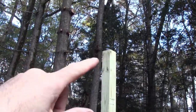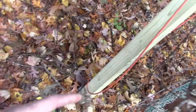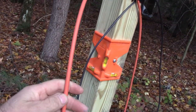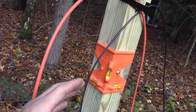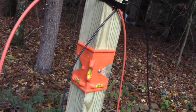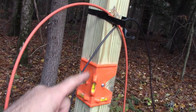The way you got to mount it, it usually comes through a building so you can wire it on the other side. But this is solid wood. Even though this is direct burial wire, you need power and ground for your camera, power and ground for your video signal - which I'm going to use coax cable for - and also two more wires for the pan-tilt-zoom control. So that's a five-wire underground sprinkler wire.